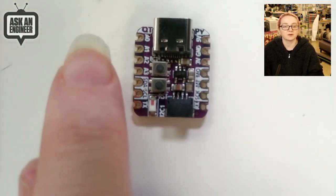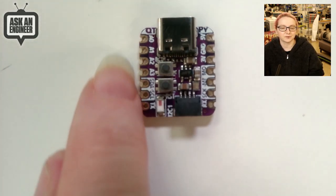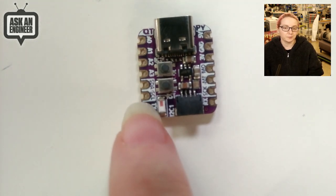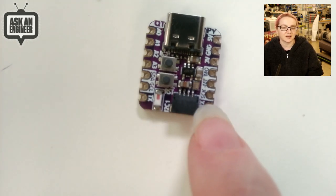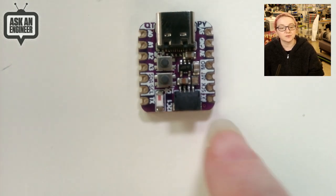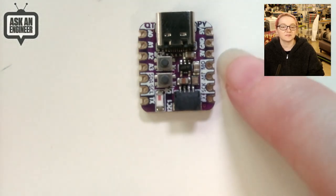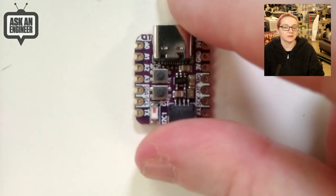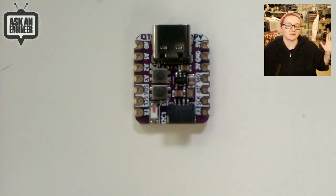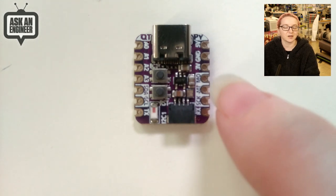So you've got analog. I think almost every one of these pins has analog, but there's four dedicated analog here, two pins that are labeled for I2C. There's a second I2C port on the STEMMA QT, so you've got another two pins. Hardware UART, and hardware SPI pins on the high-speed SPI port, which means that these three pins cannot do analog. They're the only three pins that don't, because the high-speed SPI is worth it. It's amazing, some ridiculous megahertz, like 60 or 80 megahertz, so you can connect to TFTs or some devices at very, very high speed.